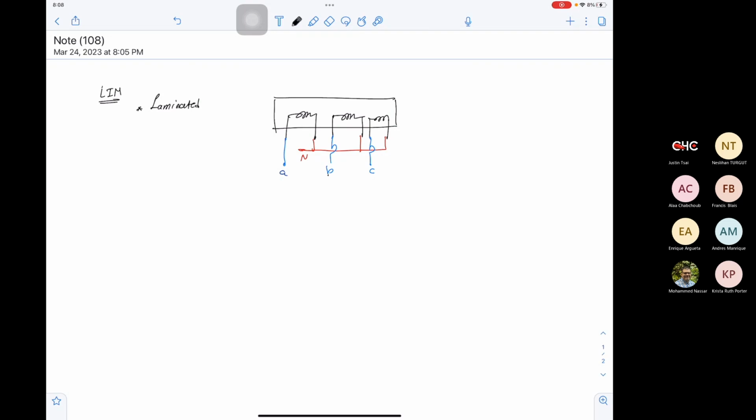When you start energizing, you can start with low voltage and then increase the voltage slightly. While you are doing this, you need an ammeter. So let's say this is coil A. I will energize this coil A and see if it is working fine. I will have a variable source and an ammeter here. You know what wire gauge you used, correct? Yes, I don't have it at hand right now. Yeah, I'm just saying you know it. So you know what is the maximum current it can carry.